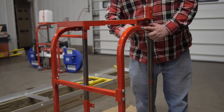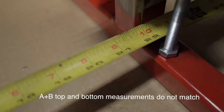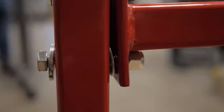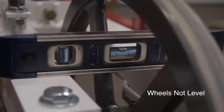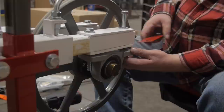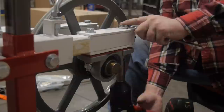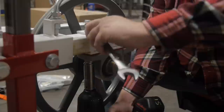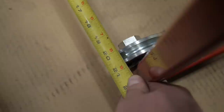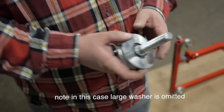Corrections for improper assembly or measurements. Cage measurements: use the extra washer and cage assembly hardware kit to correct any offset measurements. If needed, shim washers will be installed on the inside of the center support beam. Recheck that the measurement is equal on top and bottom of the lift tubes. Vertical wheel alignment: using a level to check if the mill head is vertically aligned correctly. If it is not, you may have to install shims between the bearing and the mill head — the manufacturing process during welding may cause differences in the inner head frame. Track wheel alignment: if it does not measure 20 and 3/4 inches between track wheels center to center, alignment washers can be added or subtracted to achieve this measurement.